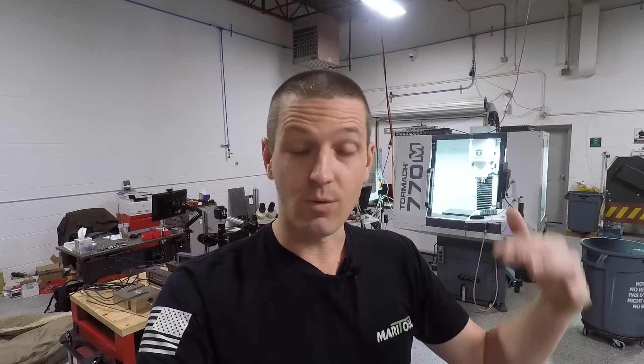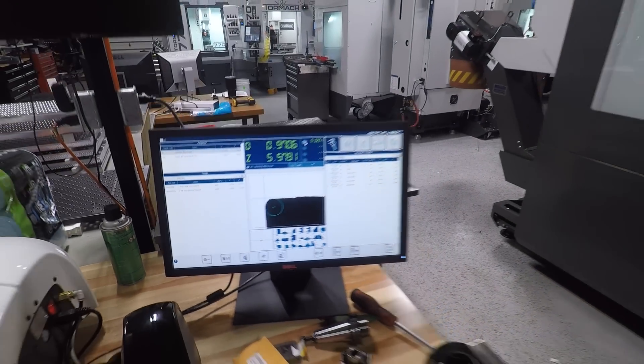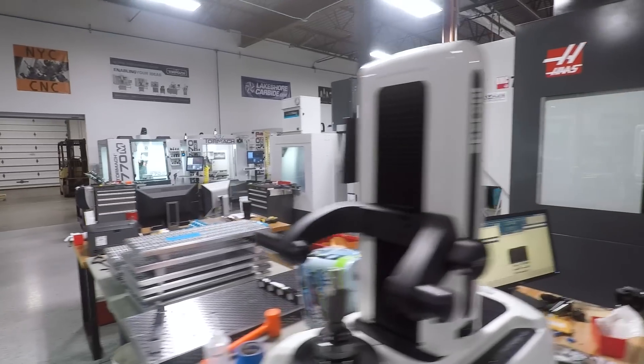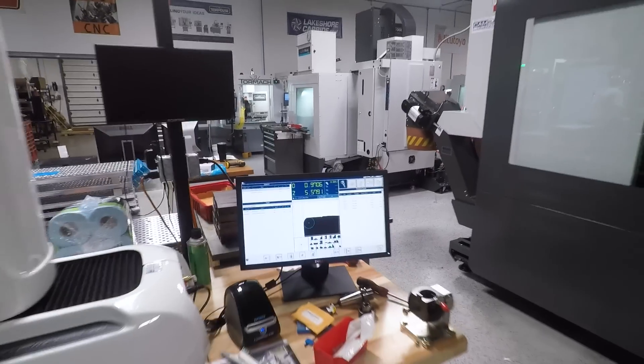For ball or bullnose end mills, if you have a mill-drill or one of those 90-degree chamfer tools and you break the tip off, previously you couldn't use it anymore because when you set the height of that tool, the tip is missing — meaning you don't have a way to show the proper length and correctly calculate how to run a chamfer. This lets you put that tool in, use one of the macros, and it finds the theoretical center point that doesn't really exist and gives you the correct length. We're using it for CAT 40 tools, and we also have a hydraulic holder that's three-quarter inch that'll let us drop in Tormach TTS tools — the installers actually set that up as another adapter so we can get correct tool length for the Tormach system as well.